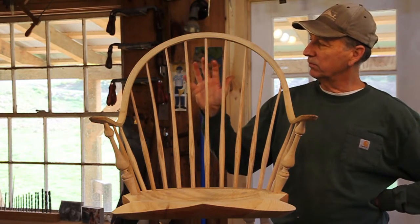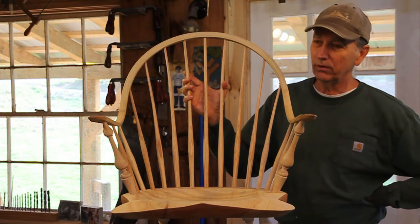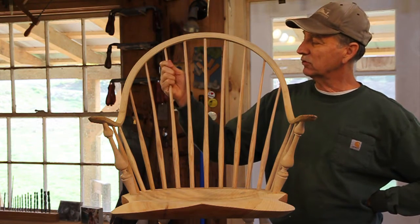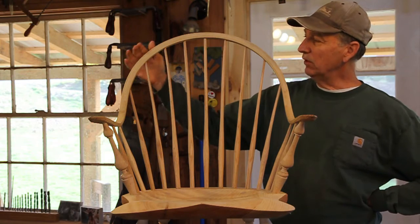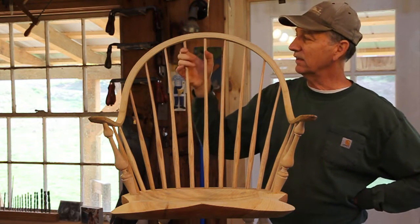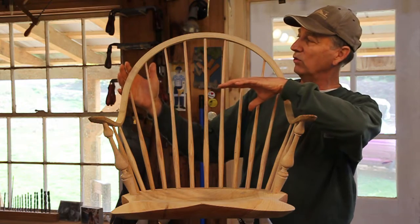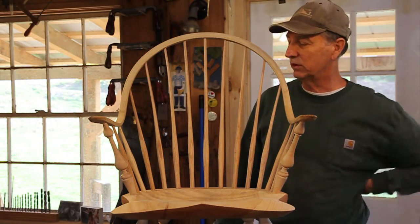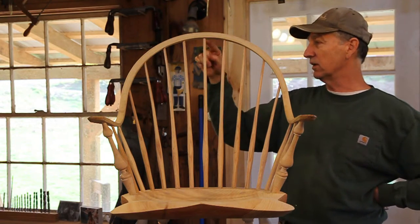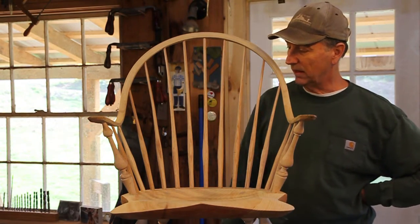In the lengths on the plans I've got the three center spindles at 24 inches — about an inch and a half longer than needed — and the others are like 22 and 20 and so on. The reason I have so much extra on the center ones is that when assembling the chair they act like a third hand. I put the chair on those three spindles and then I've got both hands free to work the other spindles into the holes. That's why you might see a discrepancy if you're measuring and the numbers don't quite add up — that extra length accounts for it.